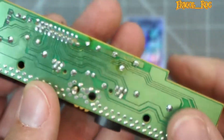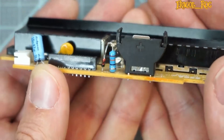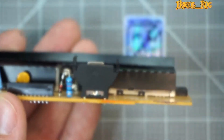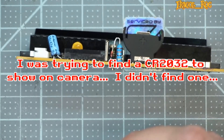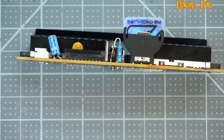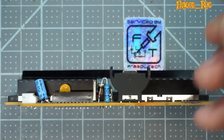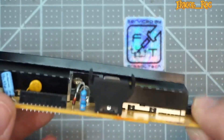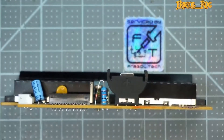Let's clip off that bit there — looks good. We got the little diode installed. This disables the recharge circuit, so now we should no longer put ML2032s in here — go ahead and get rid of those. Instead, we're going to replace them with CR2032s. They are readily available; you can get them from most places like Console5, or if you know what to search for online, you can find the coin cells for the CR2032s. Make sure that the black bar on the diode is pointing down and that you've purchased the correct diode. Alright, good luck.